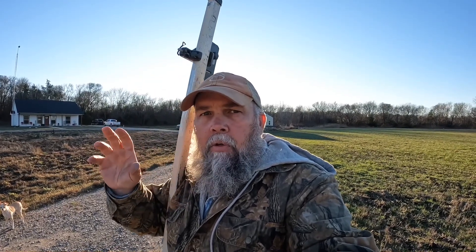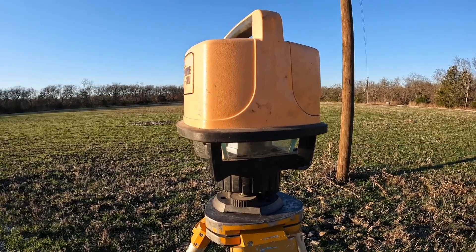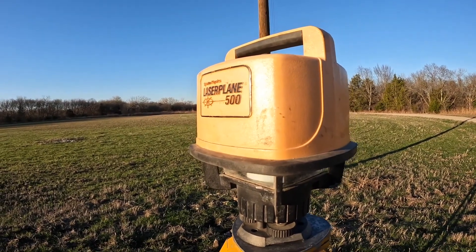A simple way to do that is using a tool like the one we're using today — a laser level. Some people call it a transit; it's not a true transit, but essentially it's a laser plane. When you get it level and the mechanism inside spins, it shoots a horizontal laser out over the landscape. We can't see it, but the laser is there, and what it allows us to do is set our survey point and determine whether everything beyond that point is higher or lower than our original point.